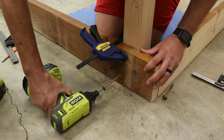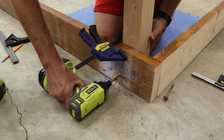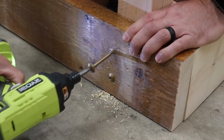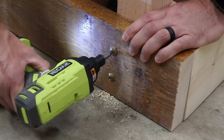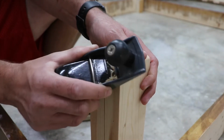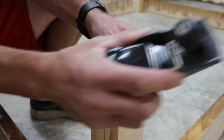I used these 4-inch Power Pro lag screws to hold the legs in place. These screws are awesome. I'll leave a link to these and other items I used in the description below. I added a slight 45-degree chamfer to the bottom of the legs to prevent splintering, then sanded the surfaces smooth.